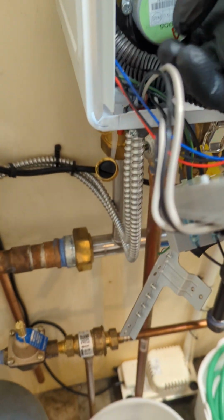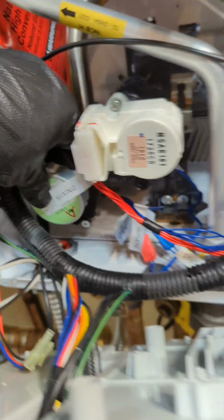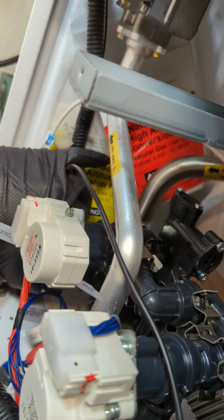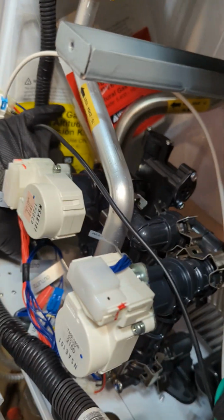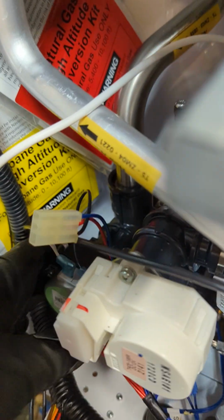That's why you want to drain it as much as you can, so you're not gonna have a lot of water inside the system. Let's take a look at what's inside of this. See, there's some dirt there. So it does need a regular flushing every year. At the end of the winter season, you just flush the thing out.